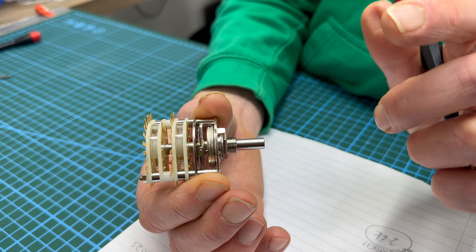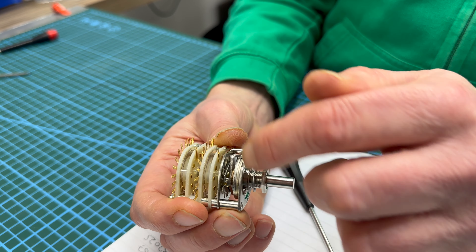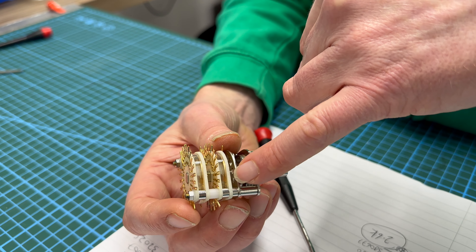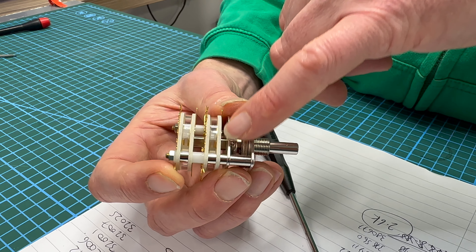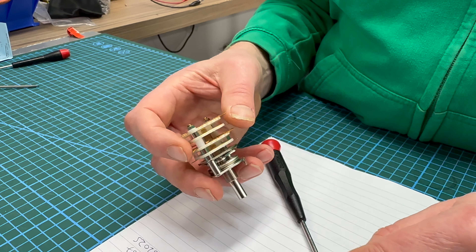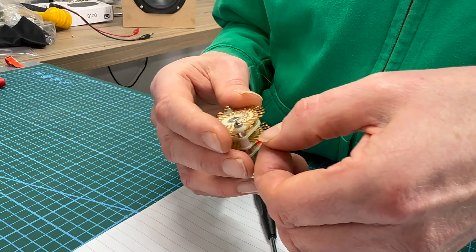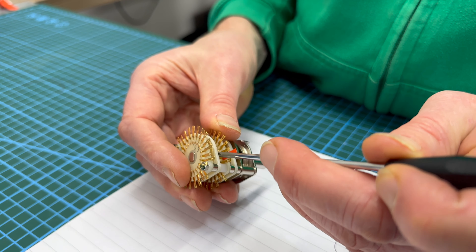What you need to be aware of is you need to mark where the start point is, because you can move one of the lugs to get it where you want it to go, and the other one will move as well. So I'm going to get it all the way clockwise — that's position one — and you can see the wiper there is connected to this pin. There's a wiper internally and then the pins there. So I'm going to place this red marker on that pin. So it's that one there. You can see the marker so I know where the actual movement starts.